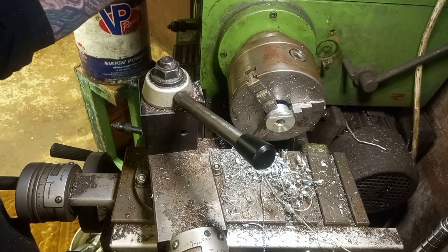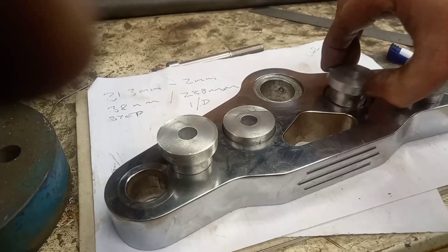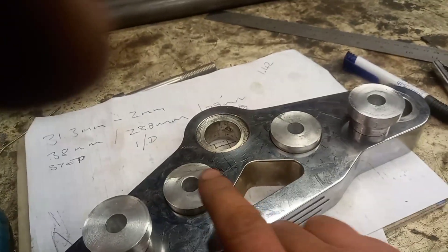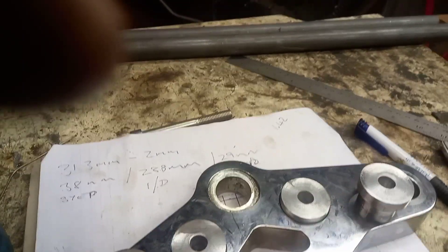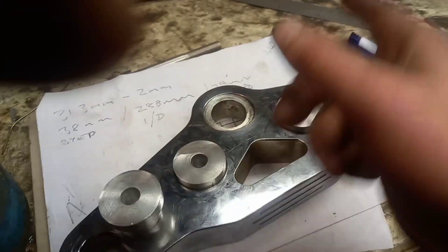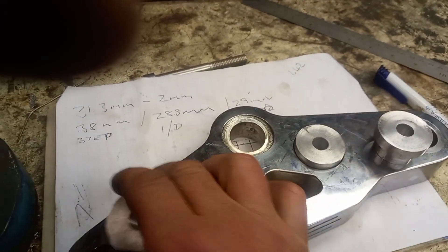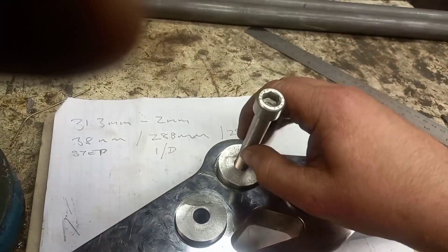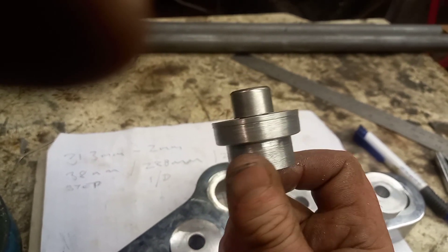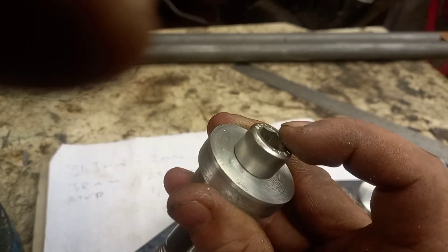So they're all drilled out now. That's how they're going to sit in there. Rather than look a bit boring, I'm going to put a boring bar in the tool post and just machine a bit of a design into the top, probably around the same size as the tube which is 28mm. These ones here are going to be taking the bolt, and I want to counter-bore the head of that bolt into the boss so the whole thing is sunken away - when the bolt goes up inside the yoke, you just see the flat face there.